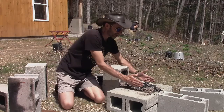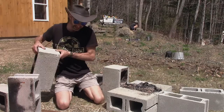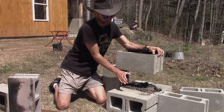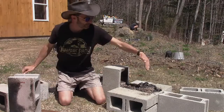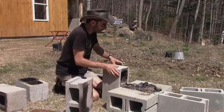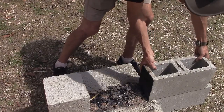Right in front, you have one where the fuel goes in — this is like the tunnel where you're putting fuel in and where it burns. To create the chamber, I decided I wanted it to be a little bit more narrow. The reason is that I wanted to be able to take an eight-inch cinder block and hover it up on top, with the side supports coming in a little bit to support it on either side. I also wanted a back wall, so I used a six-inch cinder block on the back.